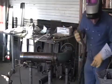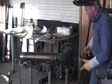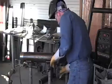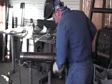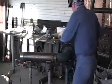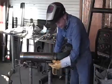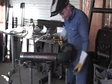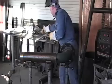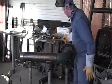Oh yeah. I'll tell you, this 6010 series rod, 5P+, it's just a super smooth rod. I'm going to break this loose, get my clamps out, my spacer out. But I'm not worried about this going anywhere — I've got a good tack on the top. I've got the flange support here on the jack stand hand. Go ahead and work that out of there.